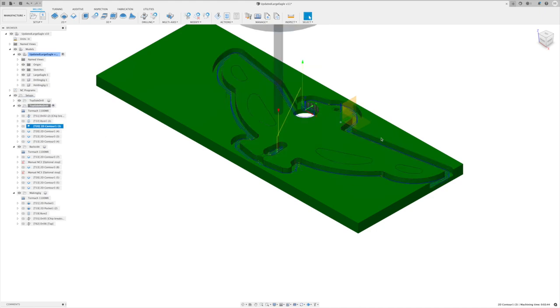Again, I've got these speeds and feeds set up for titanium, so our test piece we're going to cut will be aluminum. It's going to be a little bit slow with extra cuts, but I find that in titanium with a 1/8 bit, about 25 or 30 thou deep is all I can do. So we're going to go around that profile three times to go 100 thou deep. It's going to go 33 thou per pass and feed down through there.